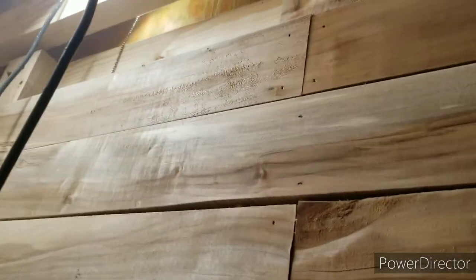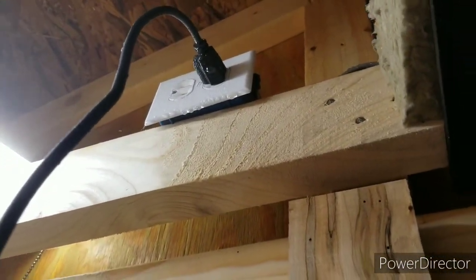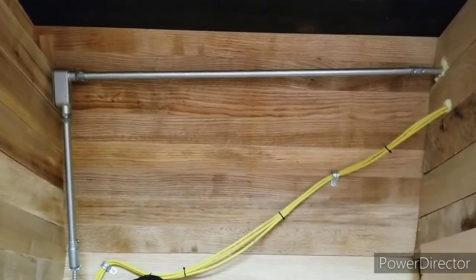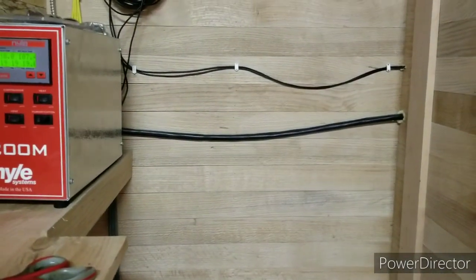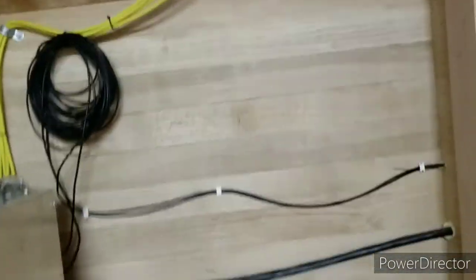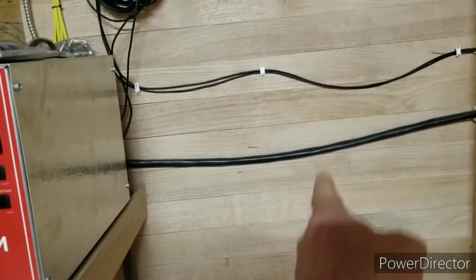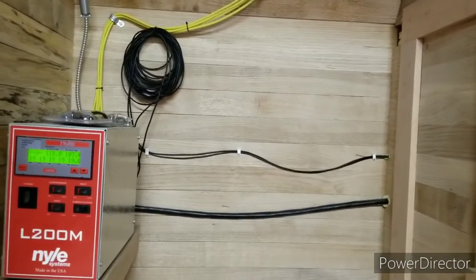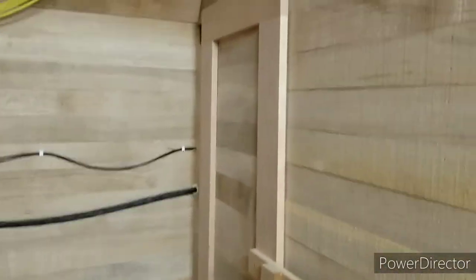When this side heats up, if there's any humidity at all and it hits the outside walls, you can see I got humidity on some electrical stuff up there. It was everything that was against a cold surface — I have zero insulation behind that right there. And you can see where it's dry — I do have insulation there. There was a line of moisture on the wall right there at the stud. And it's more than likely leaking around these doors. I didn't do a good enough job sealing the door right here, and I already knew I was getting some moisture from this spot.